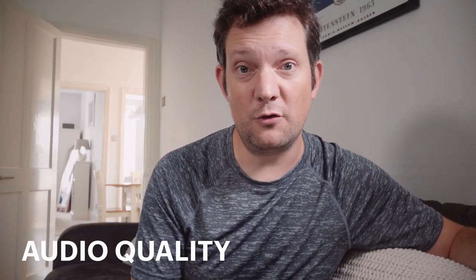Whatever you made of those audio tests, you can probably make up your own minds as to whether you approve of the audio quality, but overall for the money the mic has really rather good audio quality. Looking at the frequency response across the microphone, it has about a 6 dB boost peaking at about 10 kilohertz. What that does is give it a really nice sweet treble sound, and most people find that quite appealing as long as it's not too harsh.